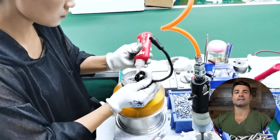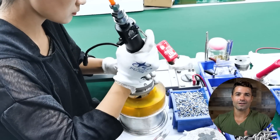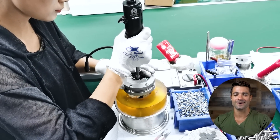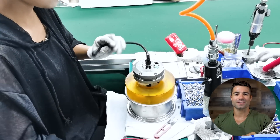The same process is done on the other side: the other side of the axle is installed to the other side of the internal motor housing. Some Loctite is applied to the screws to make sure they stay fit and snug, and finally the end of that motor wire is checked again for continuity to make sure all the wires are in place as they should be.